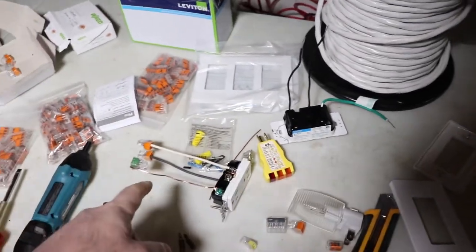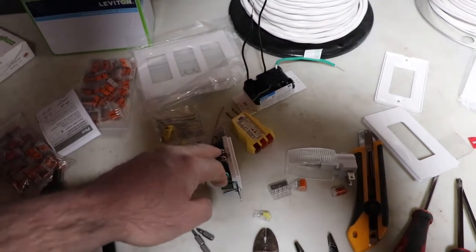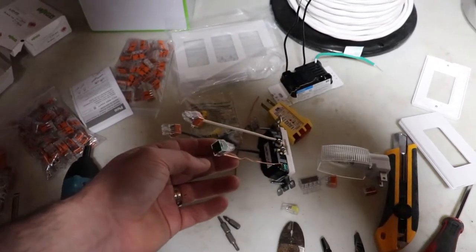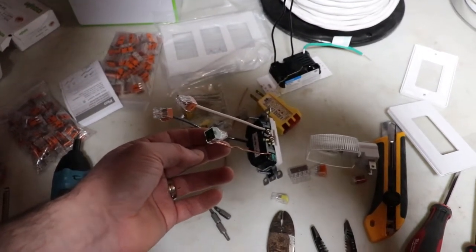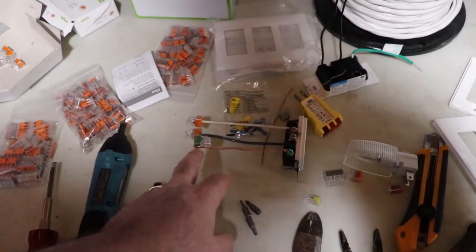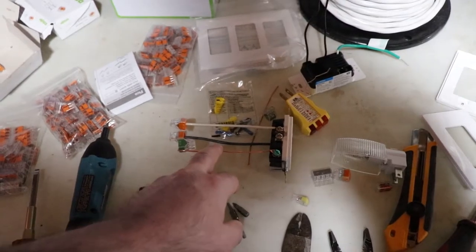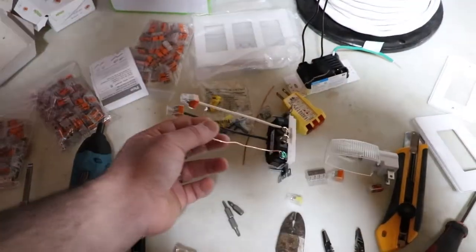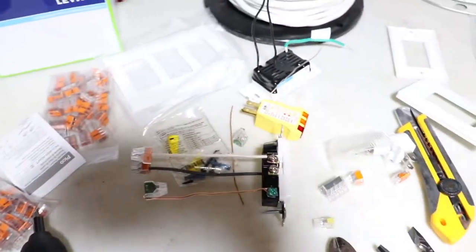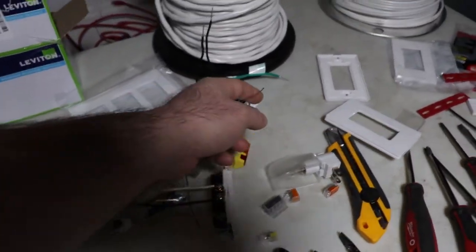What I've been doing is, in some locations I'll make a pigtail. So instead of connecting both whites and blacks to the receptacle, I'll run a pigtail if there's space in the box. And then the ground. The grounds weren't done very well in the house, I'll just say that. So I've been correcting them. And in a lot of cases, the grounds were only an inch long off the screw, and there was nowhere to get another wire under the screw. So you could just stab that on and do a pigtail to extend the ground, because the Lutron light switches, sorry, I'm going back and forth, do require a ground on them.